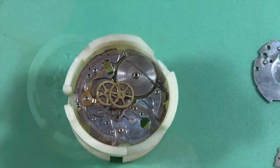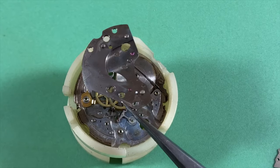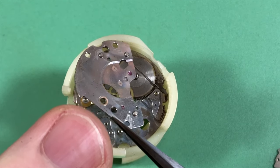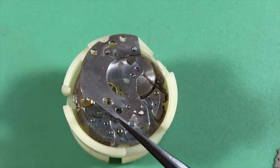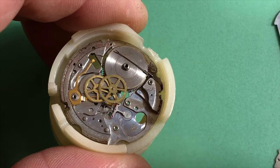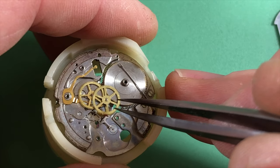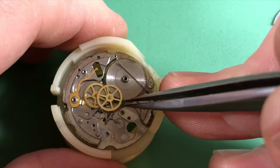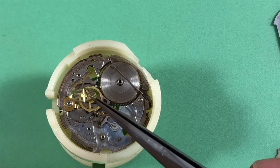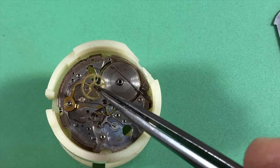It looks like we've only got little flicks here, and that is truly dodging a bullet. Things are hazy but not really dirty — I haven't cleaned this at all yet. Look at the shine on the upper mainspring arbor — that is not something I see very often. I don't think this watch had a lot of miles on it. The case is certainly worn, but the rest doesn't look bad. The lower mainspring arbor is worn — we can see the brassing around the edge — but so far I have not seen any serious moisture intrusion. Very fortunate, because this could have been real bad.